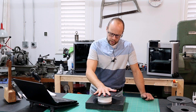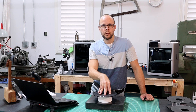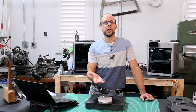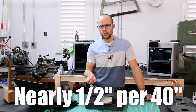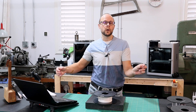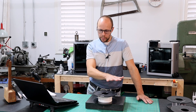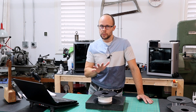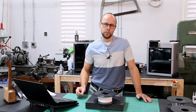If we're printing PLA at around 200 degrees Celsius and room temperature is 20 degrees Celsius, we have a 180-degree temperature change. Multiplying that out gives us 12.24 millimeters per meter of expansion. It's not exactly that simple because when we 3D print a part, the temperature is not the same throughout, and the parts aren't solid either. But roughly speaking, we're somewhere in the range of about one percent expansion that we'd need to deal with.